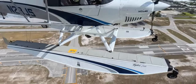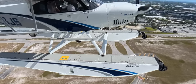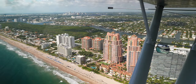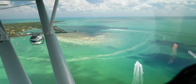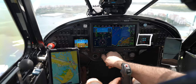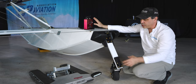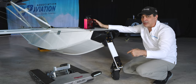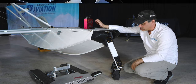The nose gear comes up and slides into the floats. Some people put a wire tie that sticks up so they can look out the window and see it's retracted. This plane has a really cool system — we have mirrors so we can literally look across to see that the gear is up or down. We have a few different ways to verify gear position: look out and see them, look in the mirrors, or check the four lights on the panel. We tow this plane with a remote tug — just one wheel and we're able to move it around.